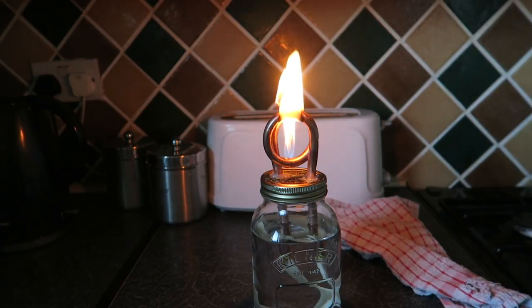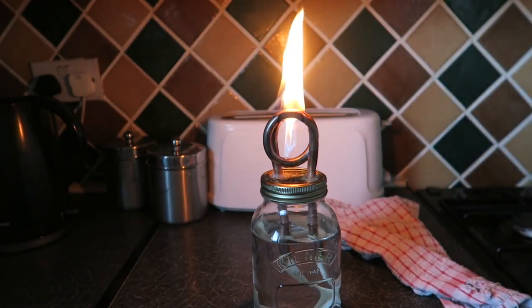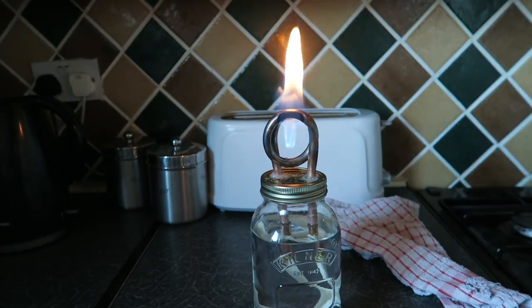In a moment now, as it warms up, the gases will start to push out. Here we go. And this yellow flame will turn all blue in a moment, and you'll have just a little arc here starting to step down as soon as it starts pushing. Now don't forget, guys, we're not burning alcohol here, we're just burning the fumes, and they're coming out under pressure due to heat. And that'll get a finer and finer burn as the coil heats up.